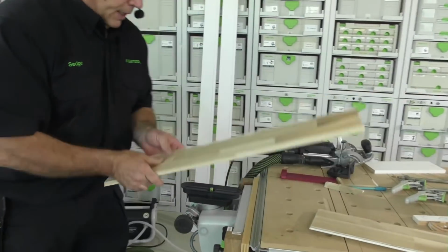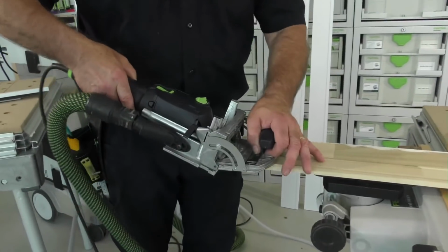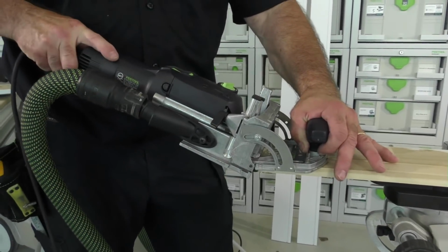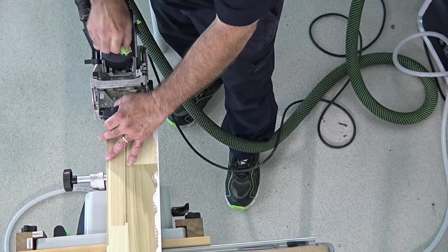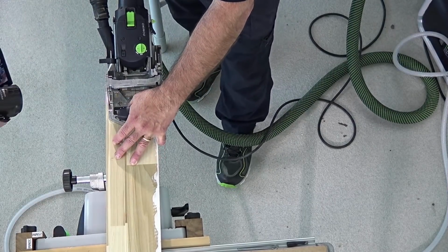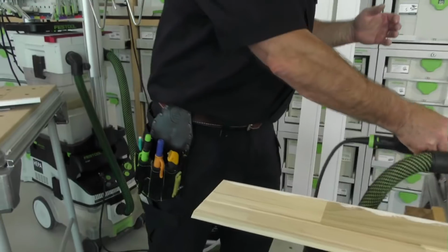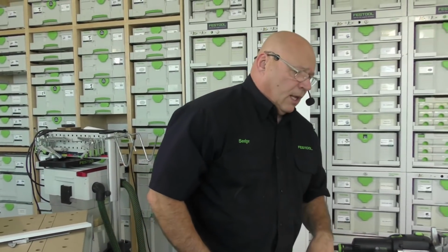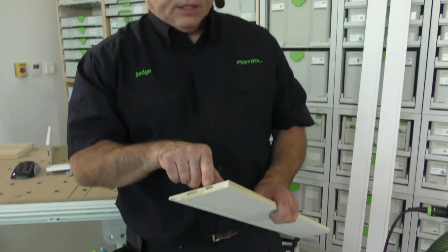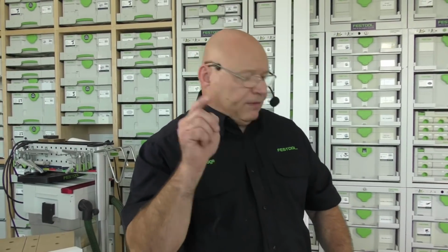Now the next piece, I'm going to take it like this. Bring it right over like this. Make sure I hook it in. I'm going to do it tight. Then I'm going to come back and do it wide. But I'm going to be eyeballing it right here on that line. I've said this in other domino episodes, that anytime I'm using the line, I'm marking the line, and I'm using my eye, not the reference of the machine, I always go to a loose setting, okay? Oh, the domino bevel was episode number 55, in case you need to reference that.